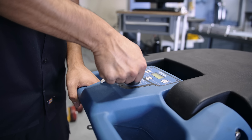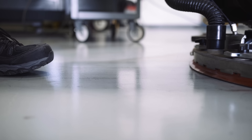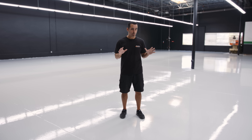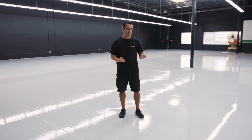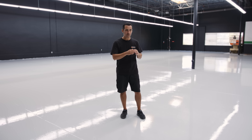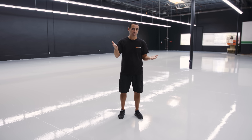As far as texture goes, you can add texture for slip resistance. I'm not a fan of that because we clean our floors weekly and we have a walk-behind floor scrubber, and texture doesn't squeegee up the moisture and cleaning agent as well when it has texture on it. Some machines apparently work better — not the one we got. But orange peel gives a little bit of slip resistance because it does have a little bit of texture on it. I didn't want glass smooth because when you spill something, the surface tension just spreads. The orange peel is that sweet spot between a glass surface and a textured surface. I'm so blown away and super happy with how it turned out.